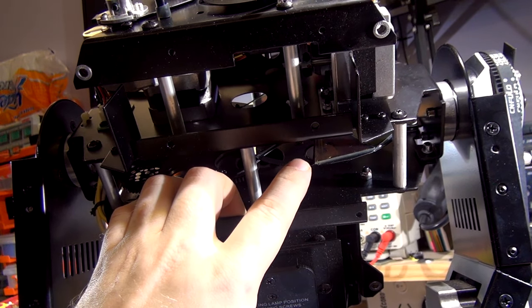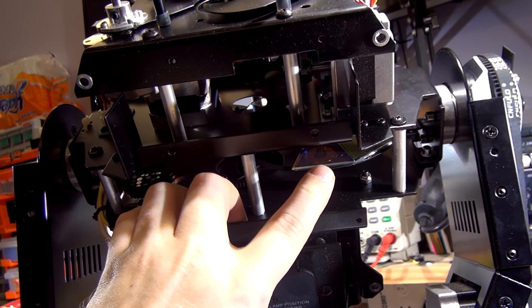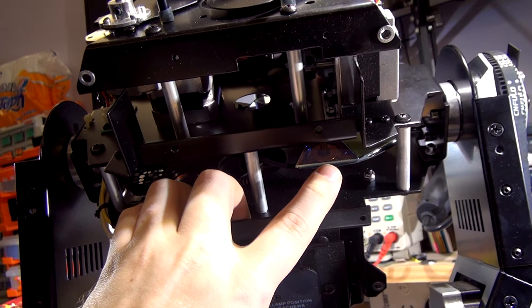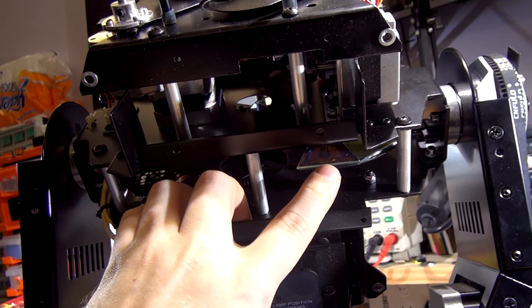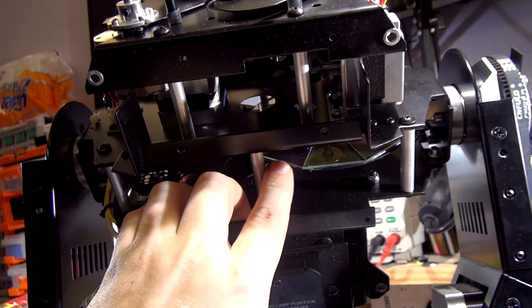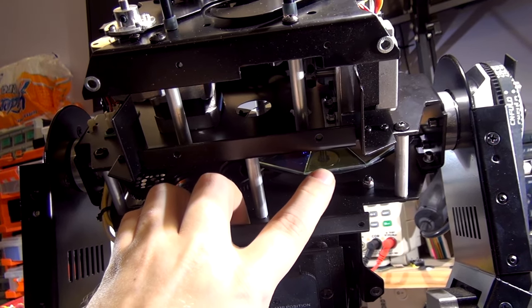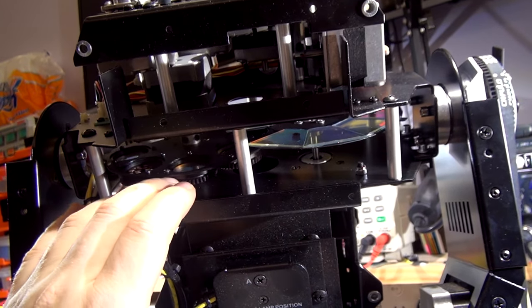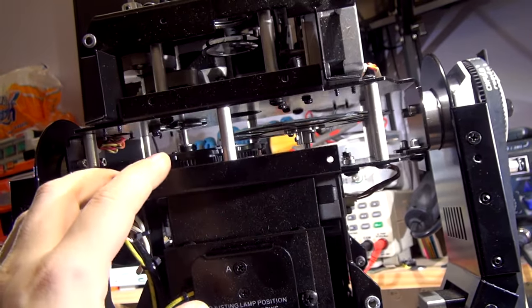In this light it doesn't matter which value you select — it'll pick the same color. Say if I select value 10, 15, or 20 it stays the same; as soon as it hits 30 it goes to the next color, then 31 through 59 will stay the same, and so on. It will not gradually move. Same with gobos, except the rotation — you can adjust that. The focus mechanism is exactly the same as the other light.